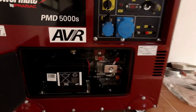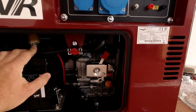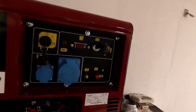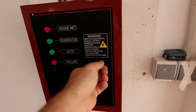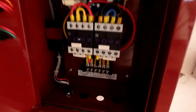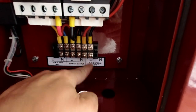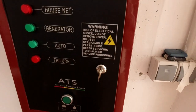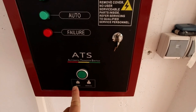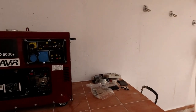So let's start slowly. First thing I've done is connected the battery to the generator, put some fuel and oil, so now it's ready to start. The next thing is going to be this transfer box. We have a city power input, a power output, a generator input, and at the bottom we have our signal cable — it's a five-core signal cable — and we have one button for automatic and manual modes.